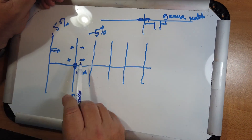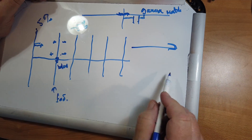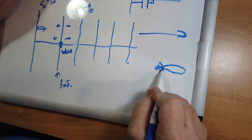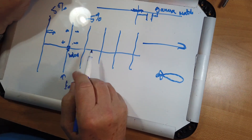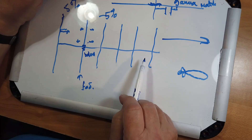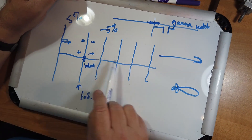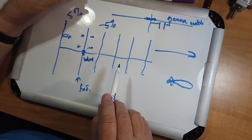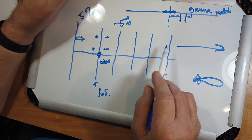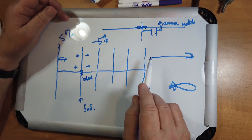The directors are all the same length going out, and you can add as many as you want. This will give you a strong beam in this direction — the beam looks sort of like a dirigible, with little tiny side lobes. The spacing of these elements was always assumed for many years to have to be uniform — either close-spaced or wide-spaced, but uniform. Recent computer modeling, in the last 20 years, has discovered that the optimum Yagi does not have uniform spacing between these elements.